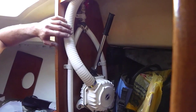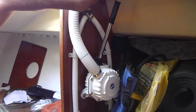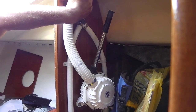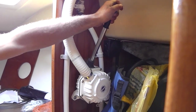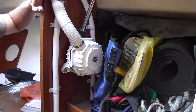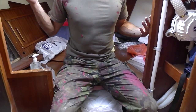So this replaces the lavatory - you close the lid and start pumping, then close the anti-siphon valve on the seawater, similar to closing a flick switch on a Jabsco, except this is a chunky valve. It's a chunky pump and it also disappears, looks really good. It's a little bit industrial but an extra pump is a really useful thing. We'll have a waterproof locker here.